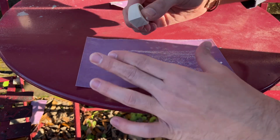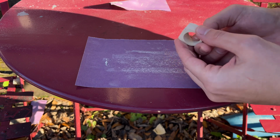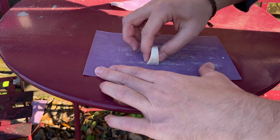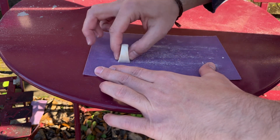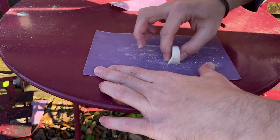I want to go no thinner than 4 millimeters, as one day I intend to engrave or maybe carve something into the final cast version of the ring. Same goes for the shoulders and the walls. This is the reason I decided to leave them relatively thicker.